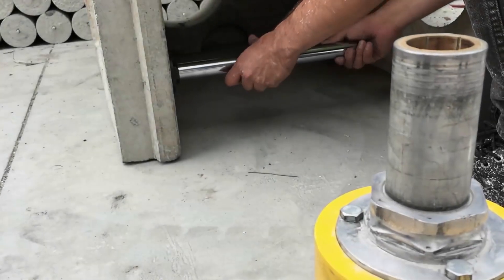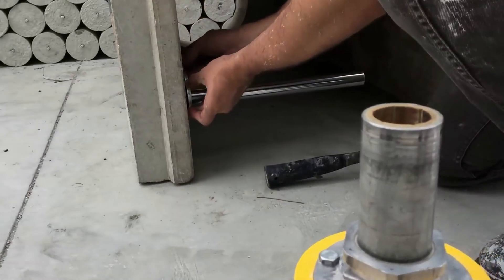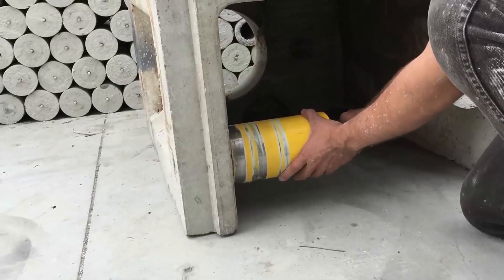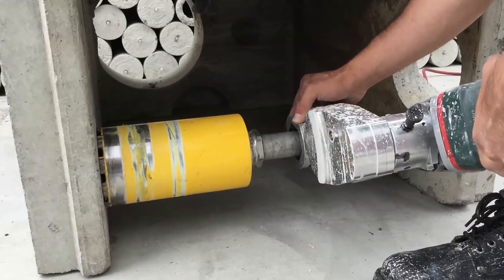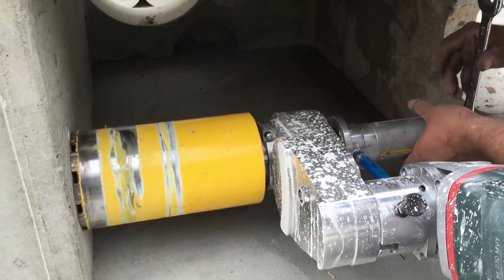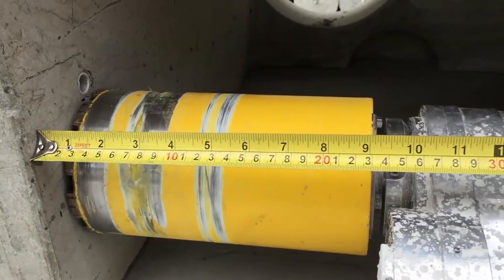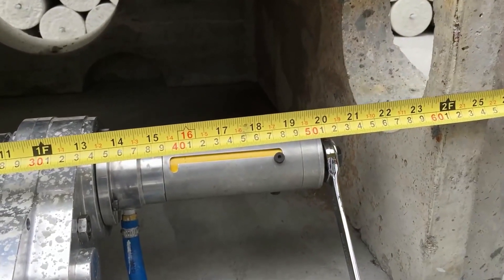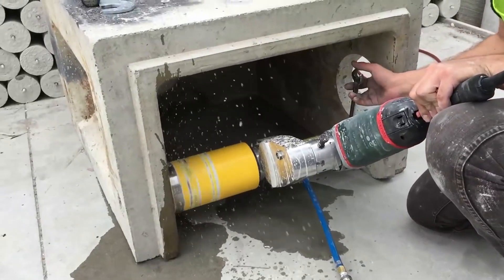The CoreEasy is versatile. You will be able to drill in a confined space with the shorty attachment, and the feed lever can be replaced by a ratchet wrench. The standard shorty attachment can drill 9-inch holes with only 24 inches of clearance. It is possible to extend the drill depth by following the 9-inch core bit with deeper core bits. The possibilities are only limited by the depth of the core bits.